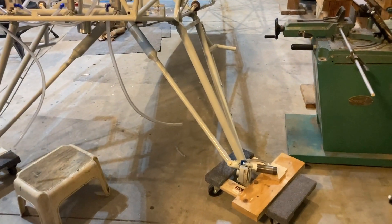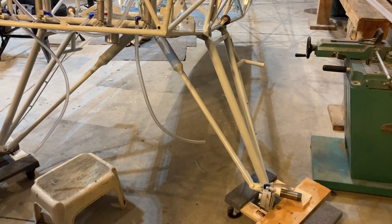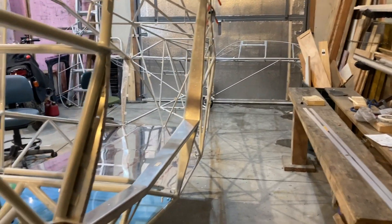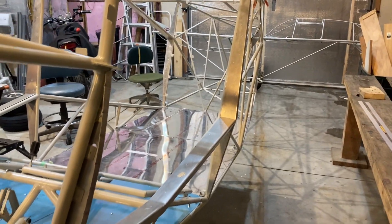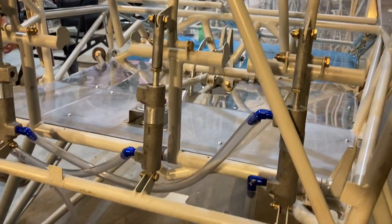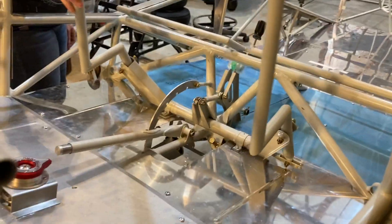What we've done: we've got the gear legs together and the struts together — thank you very much, Ken F., that was a very useful video tutorial. We then went from there and got the tail wheel on the back. We're doing an 8-inch tail wheel. We have the low-hanging fruit kind of started: part of the trim, rudder pedals and brakes installed, fuel valve, floor control sticks, and our flap handle.